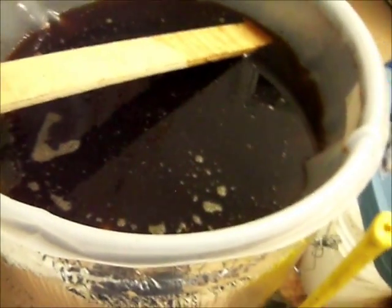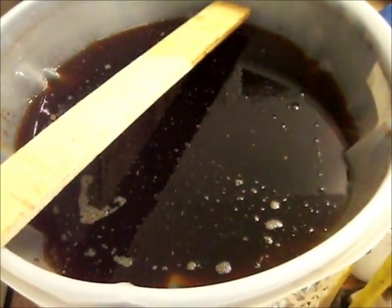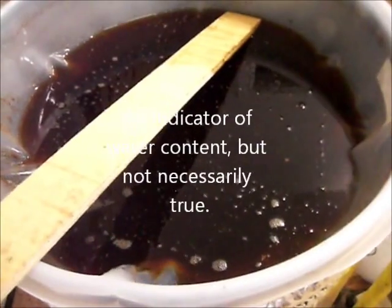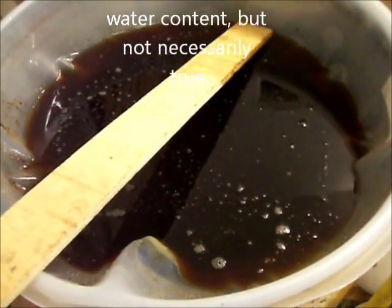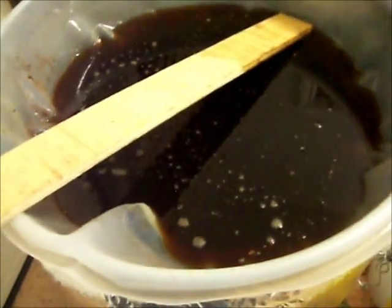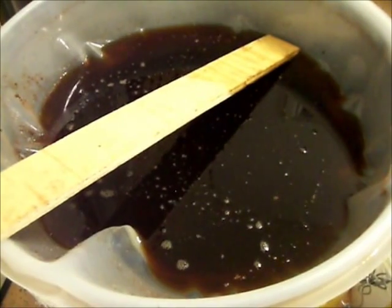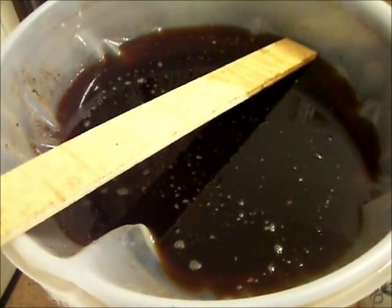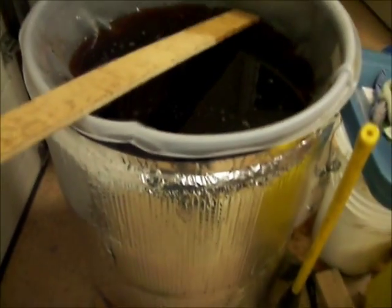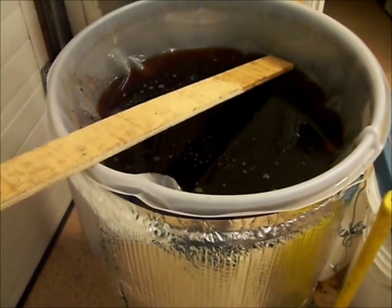You can see again there's junk inside — it's going to stay in there. It drains down pretty quick. This is pretty clear stuff, which generally means the water content is really low. If you have a really high water content used oil it's going to be fairly milky and cloudy, and that's something you want to avoid. With a really high water content it gets difficult to process into biodiesel — you're basically going to make 50 gallons of soap versus 50 gallons of biodiesel. We'll get this heated up over the weekend in the processor.